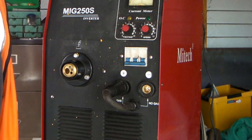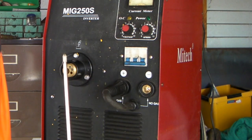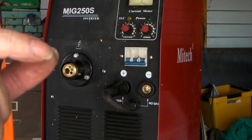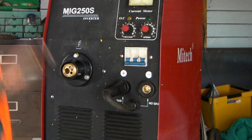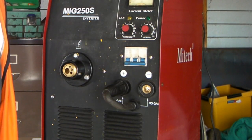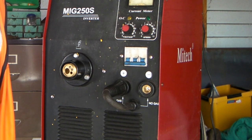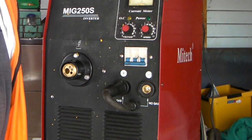It's a really good way of welding for the simple reason that you can continuously weld all the time. I started with a stick welder and I wasn't very good at it - it had a lot of slag on it. The slag is the soot that you get on your weld after you weld with a stick welder - you have to belt it off with a hammer. Whereas with this you don't have to do that, it's a cleaner weld and you can keep welding all the time. They basically call these things the 'glue gun' in the welding world because it's so easy to weld with them.